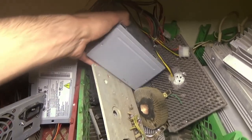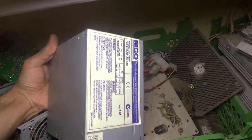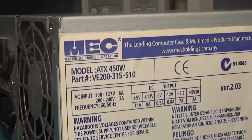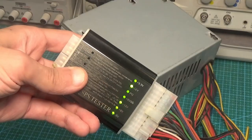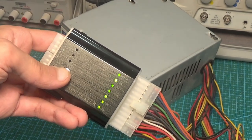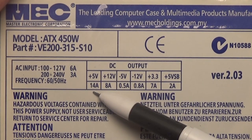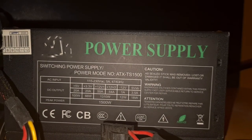We go to my warehouse and look for a suitable power supply unit. It is important to find something cheap and as bad as possible. A block was found — it's important that it is in working condition; I don't want to repair it. I plug in a tester of computer power supplies and, judging by the glowing lights, the unit is working. Although the block is marked with 450W, it has extremely modest parameters — a measly 8A on a 12V bus. Modern blocks can produce under 100A, although these cost a lot of money.